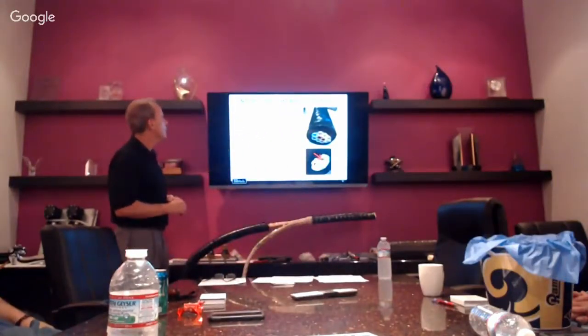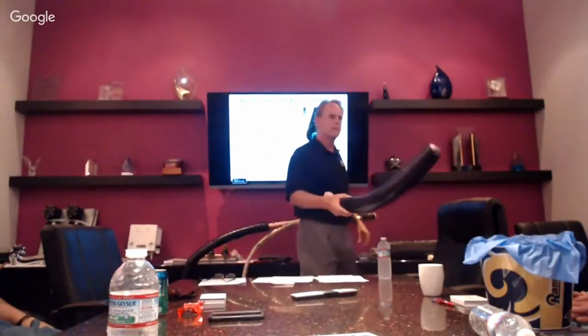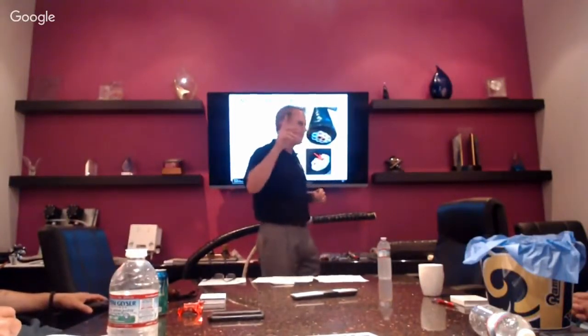Our trunk bundles. I don't know if you guys have seen these cut, but that's what they look like. And the whole point of the trunk bundle is to take the beer from the walk-in to the tower and keep it at the same temperature it was stored at. It's not designed to pull down temp. It's designed to deliver whatever it's stored at. So if you got 45 degrees in the walk-in, you're going to deliver a nice foamy beer at 45 degrees at the other end. So you generally want the beer stored at 37 to 38 degrees, and we will transport it from point A to point B and keep it at that condition. And it's going to pour great when it comes out the other end.